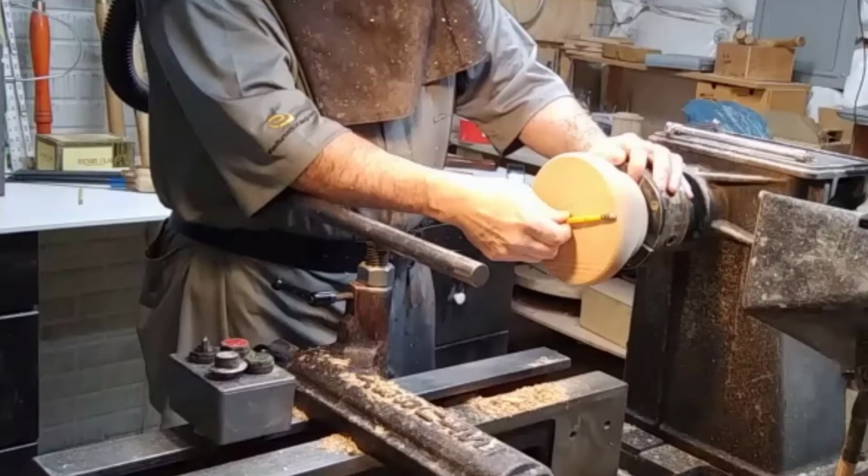His name was Professional Turner from, I think, North Carolina. Robert Farrar. I forgot his first name. He was an excellent cutter or hollower. Charles Farrar, that was his name. Anyways, for his final smoothing, he went to a negative rake teardrop. And he liked that quite a bit. It makes sense to me. I just haven't done it.